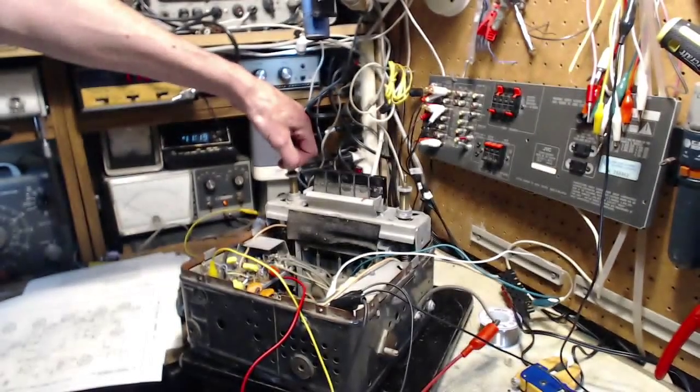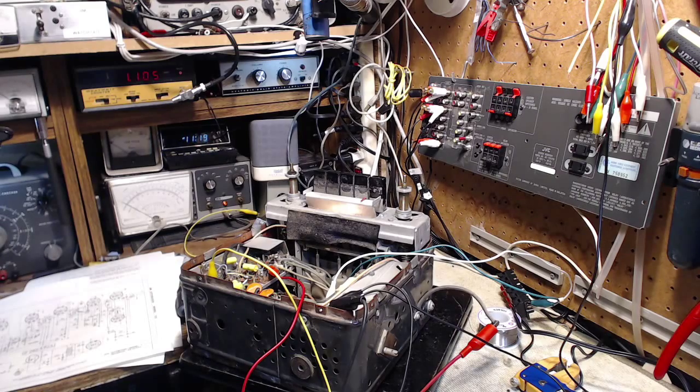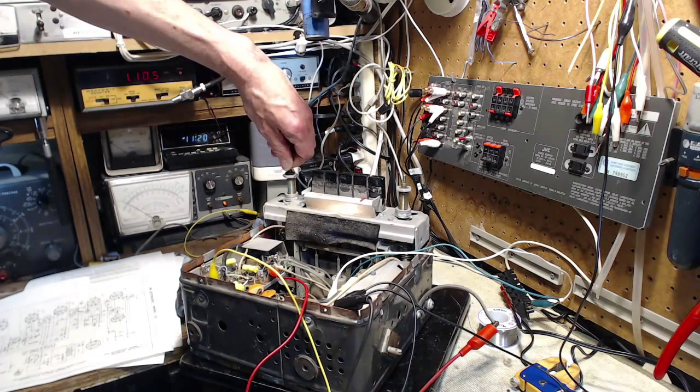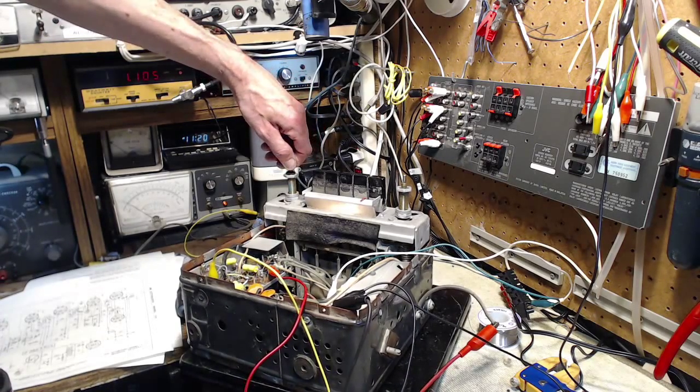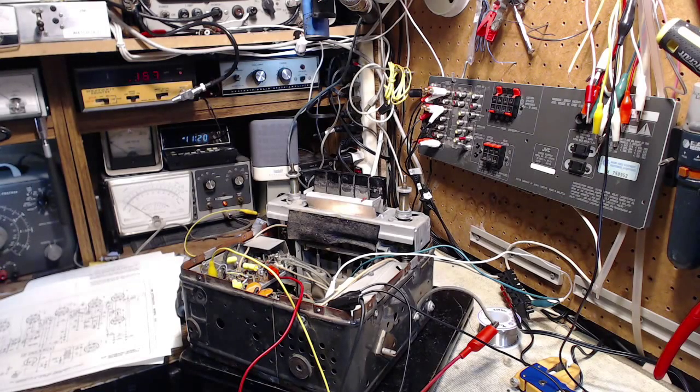Let's switch it on. Set the power supply up just a wee bit, so it's about 6.5 volts. Here, I heard a little sound coming out of the speaker there. Let's turn it up. Good show. So now we'll dial the signal generator down to the IF frequency, 262.5. And hopefully when we get down there, 262. It's way down here. There we go. Watch the numbers here. Something should happen when we get to 262.